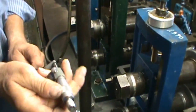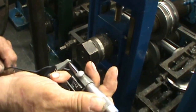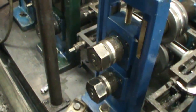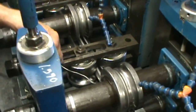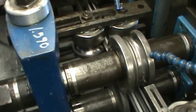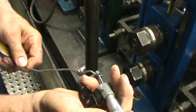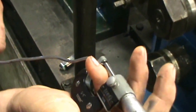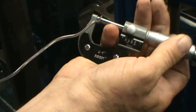We'll take a zero-to-one mic, measure and see what we have, then snip it off and do the same thing on the outer edge and mic it again. If our straight edge showed that we had a parallel, the micrometer reading confirms we are within one thou.